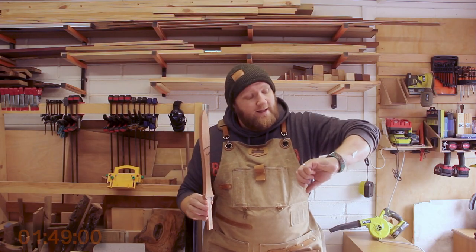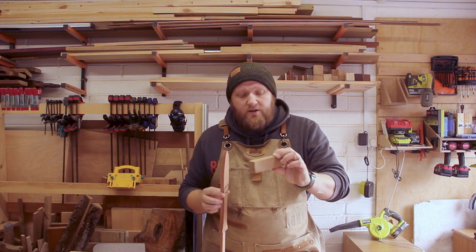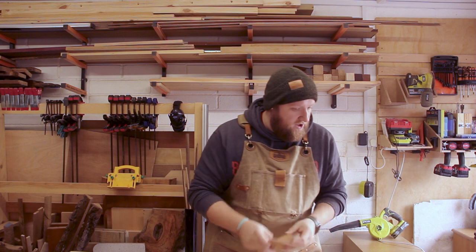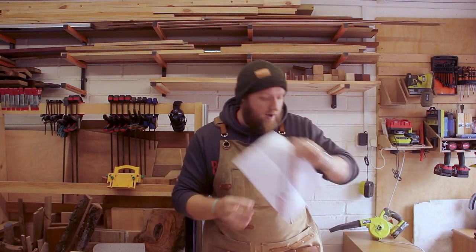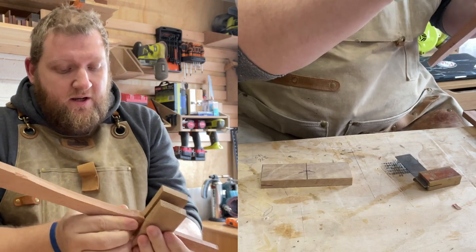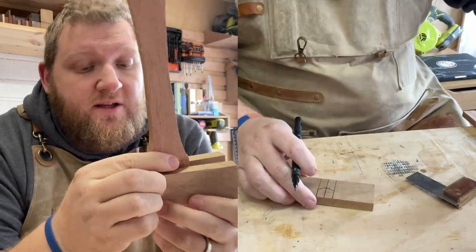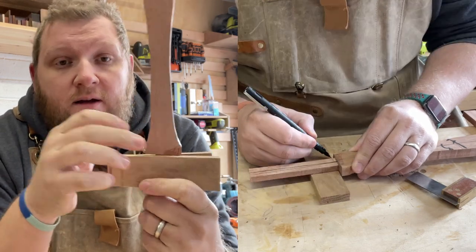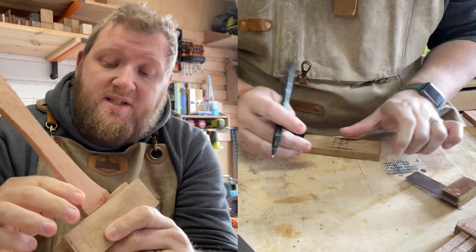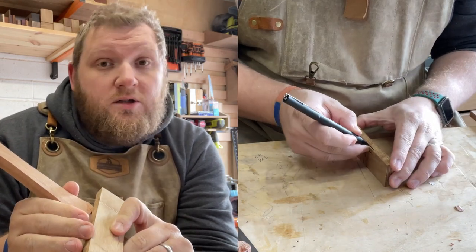Okay, the outline of the blade is done. It is 11:25. I'm going to leave this here for the minute so I can start to make the guard. The way I'm going to do the guard is I'm actually going to split it in half and then cut it out rather than trying to chisel through, because I need to have that sort of V shape that's in a lot of the pictures. With it split in half I can fit the blade down the middle, scribe where it sits, make sure it's all nice and tight, and then chisel and cut it out — which should give me that wave pattern in the middle. It should look really good.